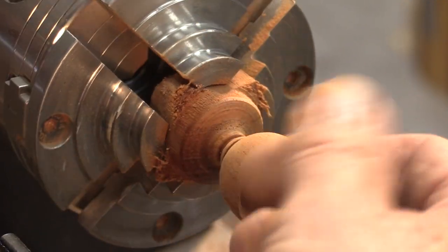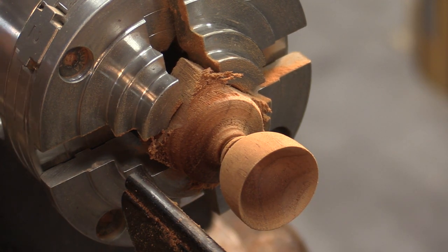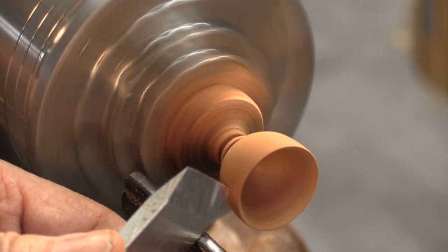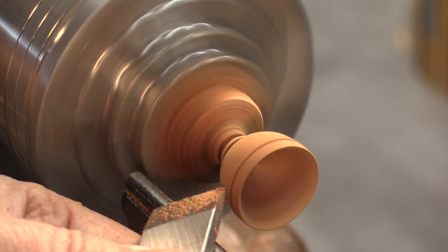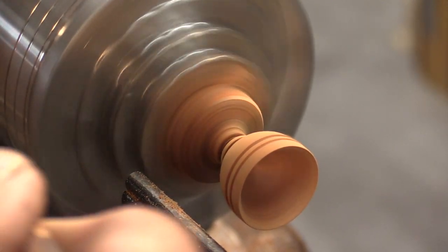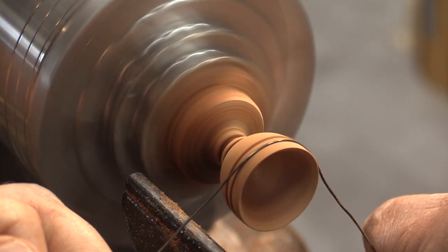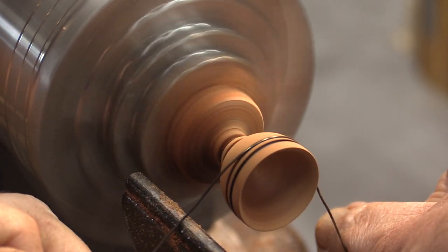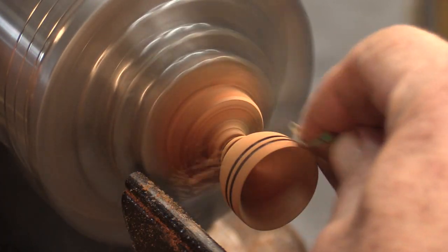It's quite a nice piece of little red cedar, but you might decide you want to enhance it a little bit more. Here's a little trick: put the lathe speed back up and use the skew chisel to make a couple of fine little grooves — putting it on its side will give a sharper, deeper V. Then with some fine wire — stainless steel or copper wire works well — hold that into the groove and the friction will make it nice and dark. Be careful with the wire afterwards as it's still hot. Then gently touch the paper back around.